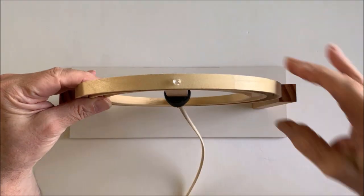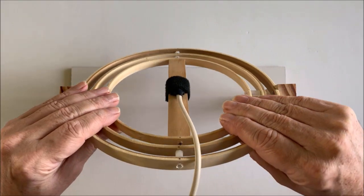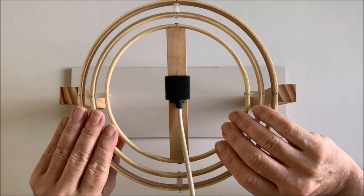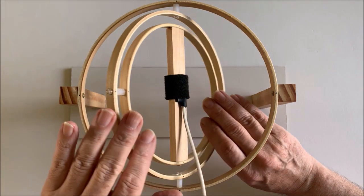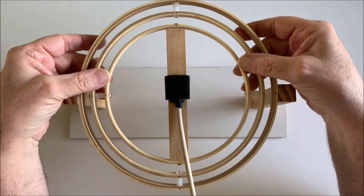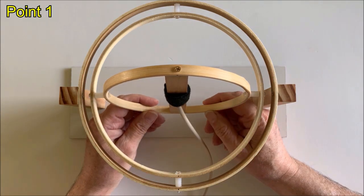We start the calibration process by pressing the Begin button on the SARCTRAC selection page. We then do a rough calibration by slowly rotating the sensor around in two horizontal axes. With the rough calibration complete, we now focus on the 12 calibration points. We point the front side of the sensor to a point halfway between the vertical and our local magnetic inclination, and wait until SARCTRAC stops beeping.